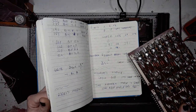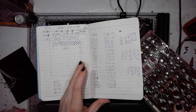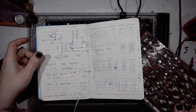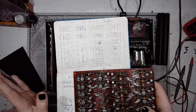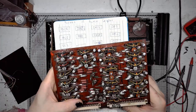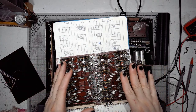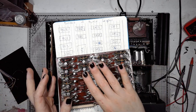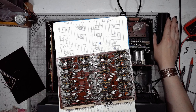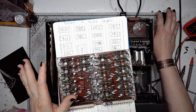That's pretty complicated, but understanding what happens in the control circuitry and how it affects the displayed digit, how it affects the content of the memory, it's crucial to repairing the board. It's crucial to locating the damage. And I had both of the memory controllers fail but in different ways. So, by swapping those boards, I could use the additional memory registers to diagnose whether the problem was with the read circuitry or with the write circuitry.